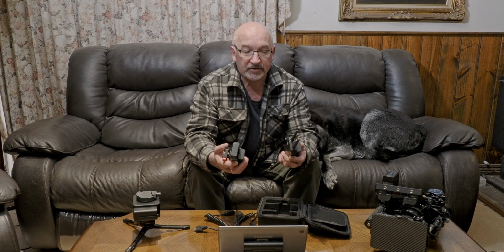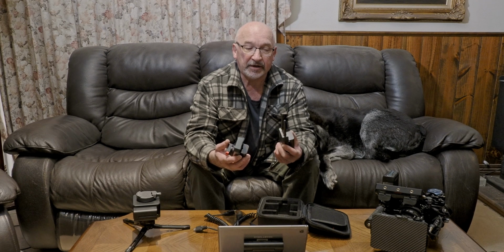The other thing about this is that it's not talked about very often, or I haven't seen it anywhere in the videos. It can take quite a while for the units to actually auto-find each other. It'll find a suitable channel. I've recorded up to 25 seconds before it actually finds each other. So it depends on how far away they are. If you bring them in close, it can be a little bit quicker, but if you have them separated for some reason, they tend to take quite a while before they find each other and settle on a particular frequency. So that's a bit of a surprising thing, but once they're locked in, they stay locked in. They don't deviate from there at all, so that part of it is actually quite good.